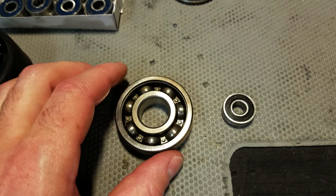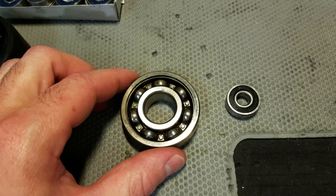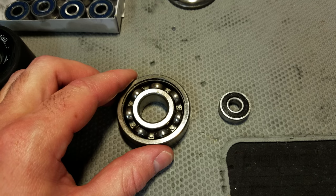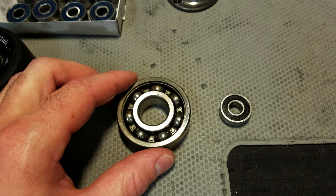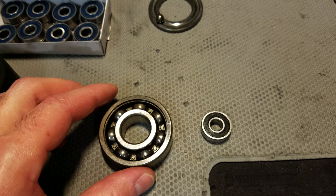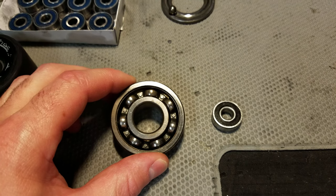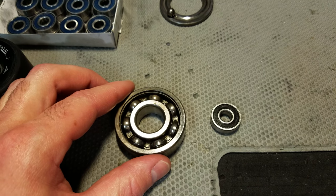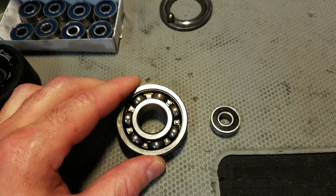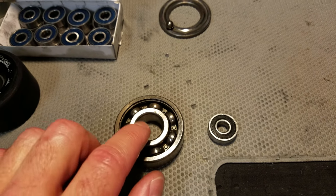The amount of balls in the bearing is really at the discretion of the manufacturer. The bearing itself is made of carbon steel — specifically, most of these bearings are made of 52100 steel, which is a chrome alloy steel. It is similar to 1095 steel for those familiar with knife manufacturing. 52100 is very similar to 1095; the only difference is it has a little more chromium, making it slightly more corrosion resistant.